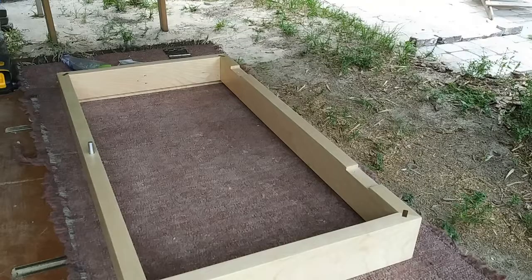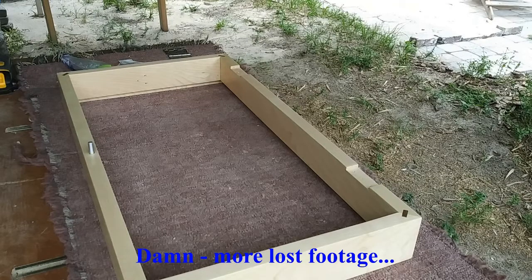After removing the hardware and sanding the entire piece at 120, 150, and 220 grits with my random orbit sander, everything was wiped down, blown off, and ready for finish. I gave all the pieces three coats of water-based urethane, sanding at 220 grit by hand between each coat.